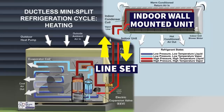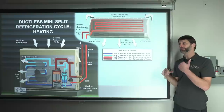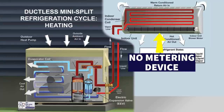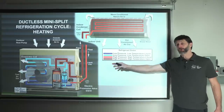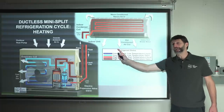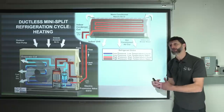You have your indoor unit with just a coil there. This is different from a single-speed ducted conventional system — there is no metering device at this indoor unit. The metering device is in the outdoor unit. Both lines in heating mode are going to be high in temperature. The refrigerant flowing through the outdoor coil absorbs heat from that low-temperature air.